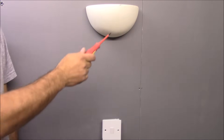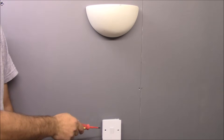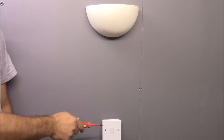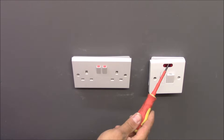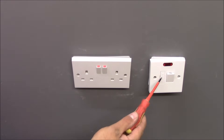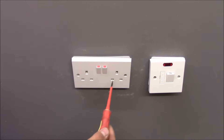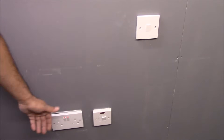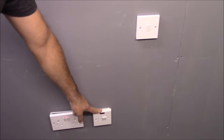So here's how all of this should look. This is our light fitting. Below we've got the one-way switch that controls this light. And below the switch we've got our FCU with a 5A fuse, and the socket outlet that we took the power from to our FCU. So all of this is legal, but you have to use the FCU — fuse connection unit.